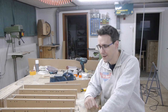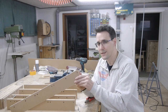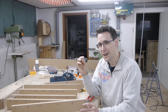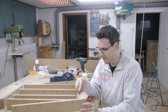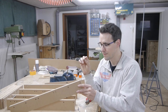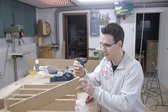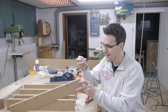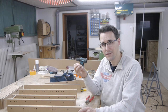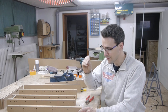Another little problem has come up. There are some points on these dividers where two of these bolts hit each other. These bolts are a little bit too long for the 10mm MDF and they stick out on the other side a little bit — but that little bit is enough. When two of them meet each other, the center hole of the nut isn't correctly aligned to the hole on the upper side. So I will have to sand down one of these nuts so it can go further into the hole and fit again.